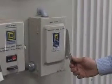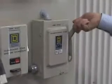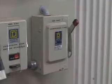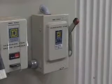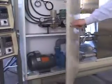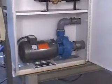Three-phase electrical power is required by the unit to operate the water pump. The electrical supply requirement is 5 horsepower, 4 kilowatt. The unit may be operated on 480-volt three-phase for operation in the U.S. or can alternatively be operated at 380 or 415-volt 50-cycle for international needs. Modifications to the water pump are required for best performance under 50-cycle operation.